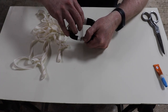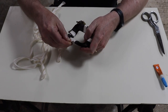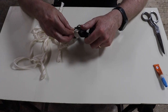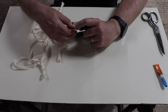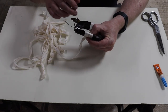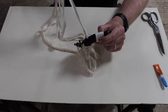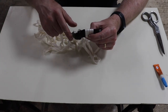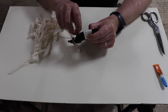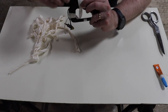And we wrap. Now, as you're wrapping, what you want to do is put the edge of the side of the new wrap that you're doing, line it up with that red line so that you're basically running halfway, or you're doing a half width coverage each time. And obviously at the start here, it's quite tedious because you have to pull all the excess through all the time. But once you get going, it obviously gets shorter and it starts going a bit quicker as well.